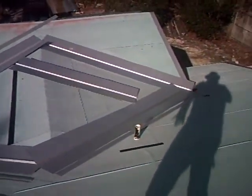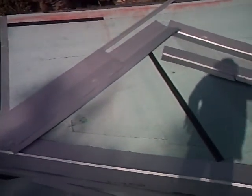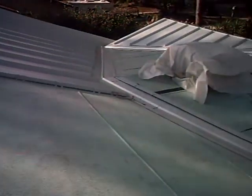Here's another example of a boot. My panels were cut to order and they've come out pretty good. I made one mistake but I think I'm going to recover because I had an extra-long panel. I haven't made this valley yet — just kind of laid the metal out. It gets a little hairy; you definitely want to have a dump into a full pan. I did 12-inch on center for the cleats in my high-wind areas, and then in the main field I go to 16-inch on center, which the manufacturer recommends.